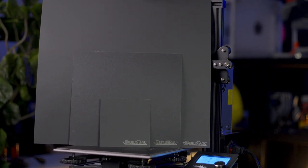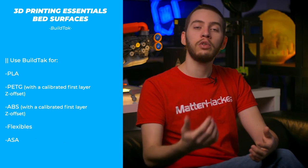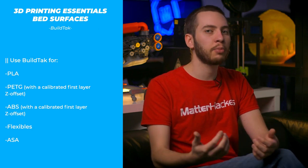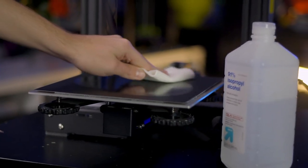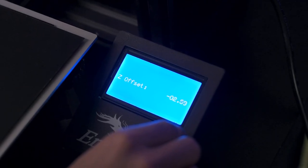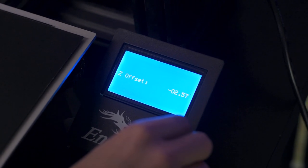One of the most common 3D printing-specific build surfaces you can find is Build Tack. It has a slight texture to it to provide grip, and can be used at room temperature or at 110°C without issue, which makes it a great choice for printers with unheated beds or for the high temperatures needed for ABS printing. Make sure when you are using Build Tack that you optimize your first layer distance, as some materials like ABS or PETG can weld to the Build Tack if you are printing too closely, resulting in small chunks being ripped out of the sheet, or even creating a tear that requires a replacement of the entire sheet. Build Tack is one of the most versatile bed surfaces in that you can use it with almost any material, except for nylon, nylon-based composites, and polypropylene. Isopropyl alcohol is the way to go when cleaning Build Tack — don't use acetone unless you want to dissolve your Build Tack. Because some materials can stick too well, adjust your first layer Z offset per material so you get just the right amount of adhesion.